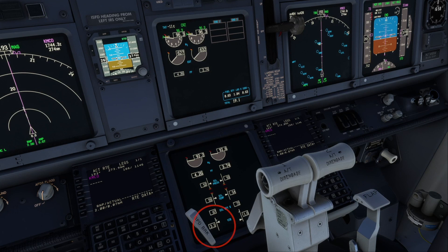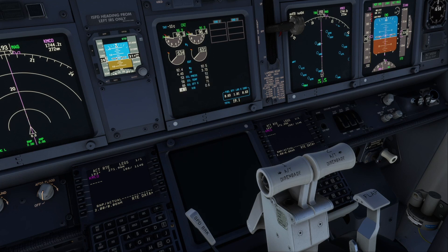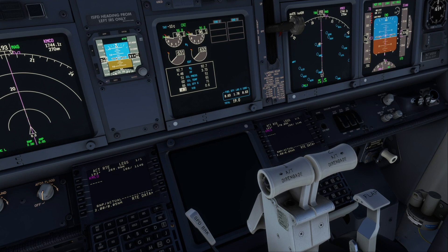Let's watch the indications of high vibration when four units is exceeded. The instrumentation from the lower display unit is moved to the upper display in view of the pilots, and a white box flashes for 10 seconds before being steady. Notice the number one engine vibration value text has reversed color, with black text now shown on a white box.